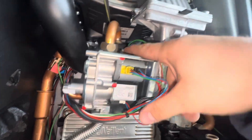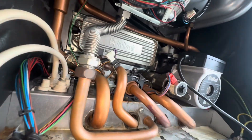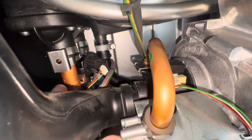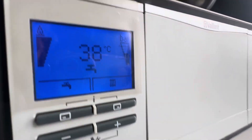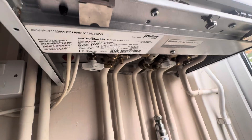Fan is in. All we're going to do is tighten up these two nuts and start up the boiler to see if it's working. Make sure this silencer is on — it could be like this and your boiler is going to make a whole lot of noise, so just make sure that's on properly. We've got the boiler on — boom, boiler's back up and running. We're going to do our 26.9 checks, FTA tightness test, to make sure there's no gas leak. We're going to spray some LDF on these connections here to make sure there's no gas leak. And yeah, it's another job done.